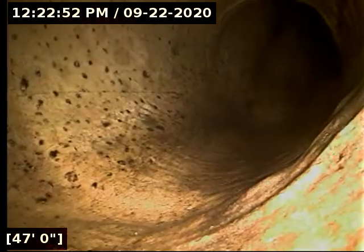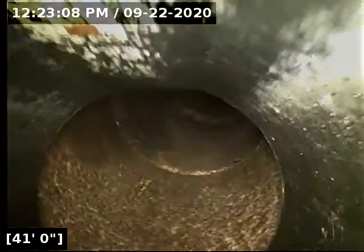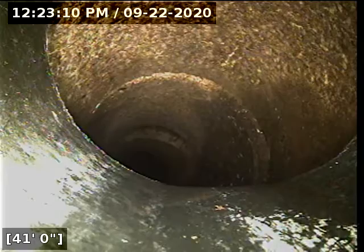Yeah, this does appear, otherwise we'd have pipe joints everywhere. Like right here, there's actually a pipe joint. This has been epoxy lined, or CIPP, which in my opinion is a great repair process. But only a portion of it here looks like was fully updated.